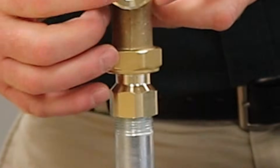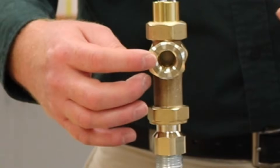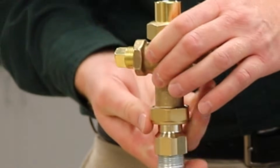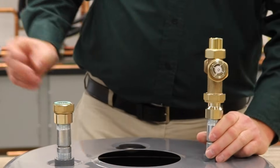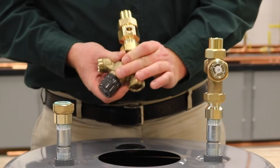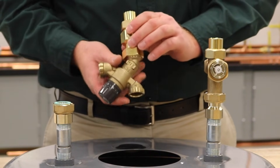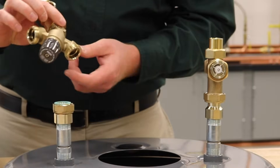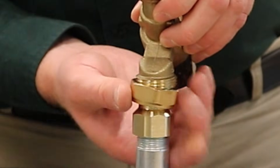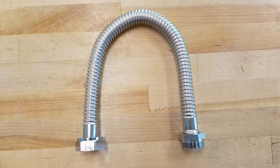On the back side, you are going to have a half-inch NPT port, which will be very beneficial if you're using a recirculation system in the home. But if you're not, we offer a half-inch male NPT plug. From there, you are going to install your mixing valve assembly. This comes with the tail pieces as well as the dry well for the temperature gauge. This is going to go on the hot inlet — you'll notice that they're actually marked with red and blue dots — so the hot inlet is going to go to the hot outlet of your water heater, again with that slip nut.